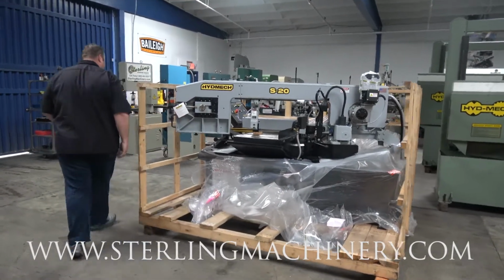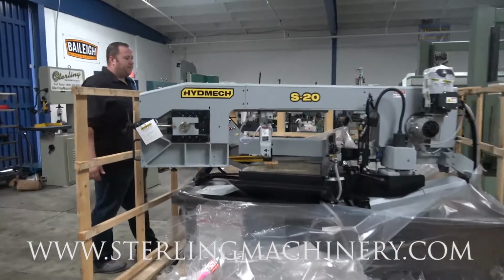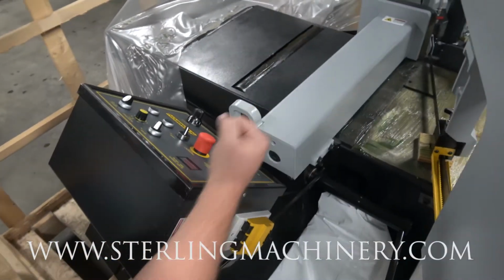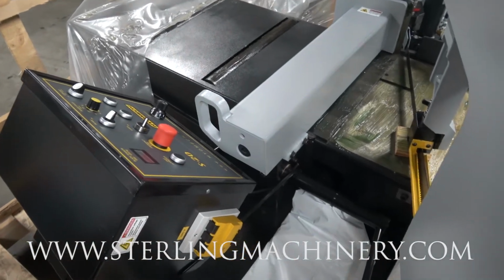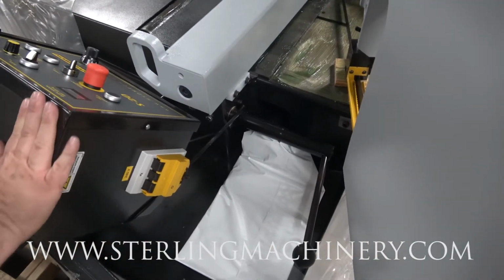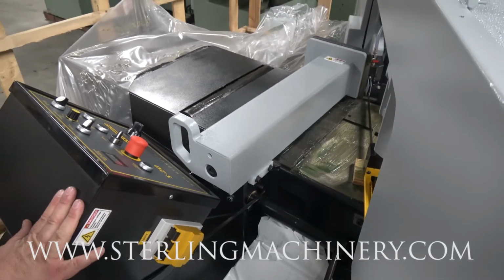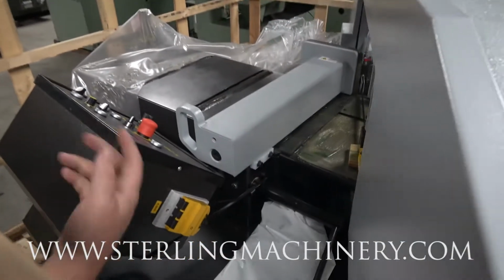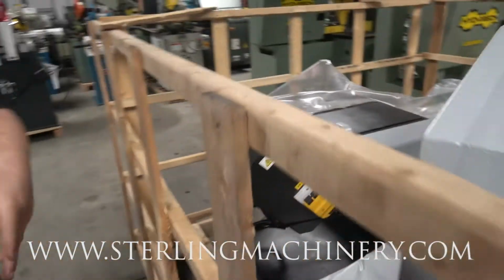Also, if you come right around here, you'll see the vise. This vise is a really quick vise. It's a push-pull vise. Push it right onto it, tighten it down right here. Your controller is going to be just simply turning it on and basically telling it to fall. After it's cut, you're going to pull your vise open, pull your piece back out, and then lift your head